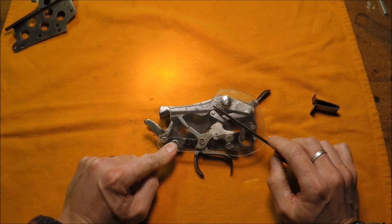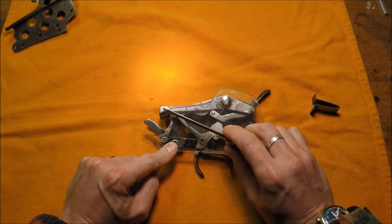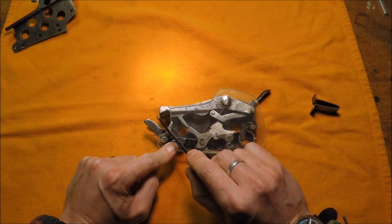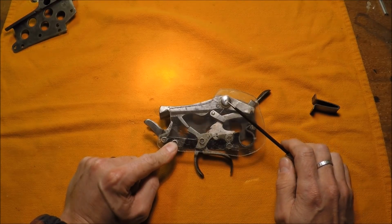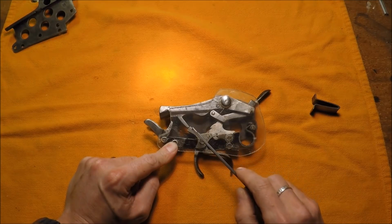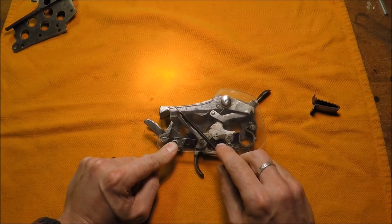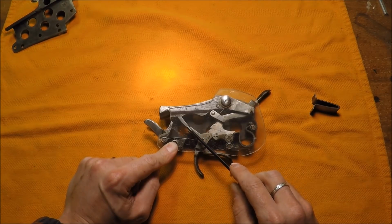The roller has finished its travel, pushing up the breech block to its fully raised position so that the firing pin is directly facing the cartridge primer. At that raised position, the locking lever has slipped underneath the strut and locked it out,